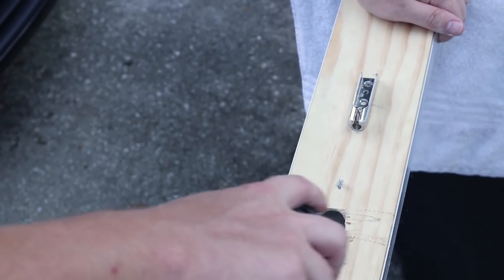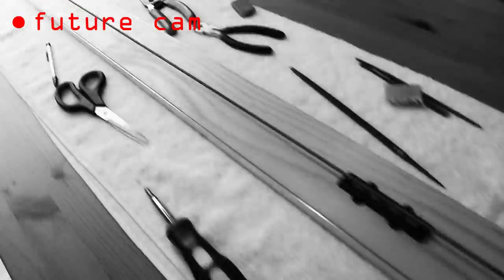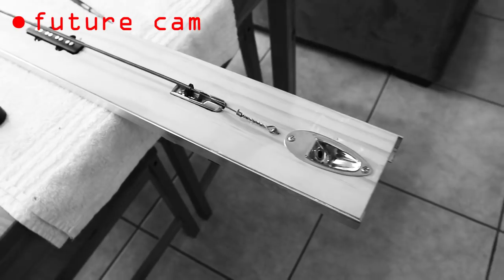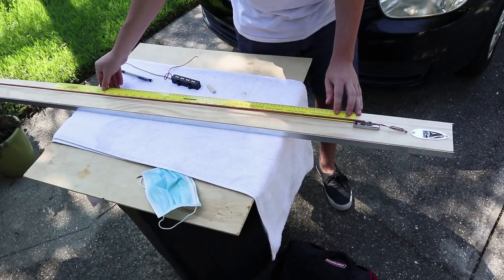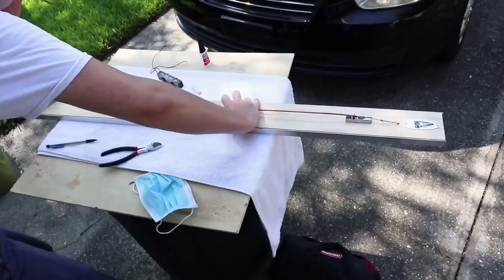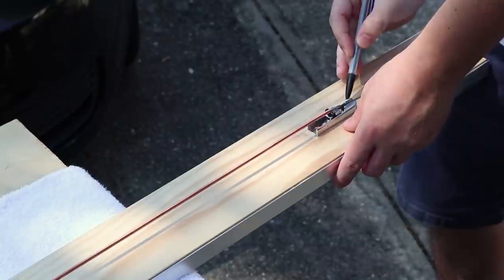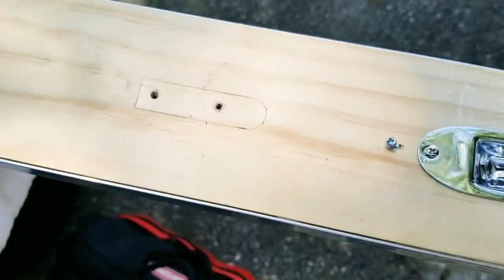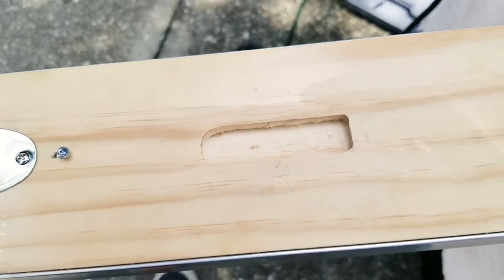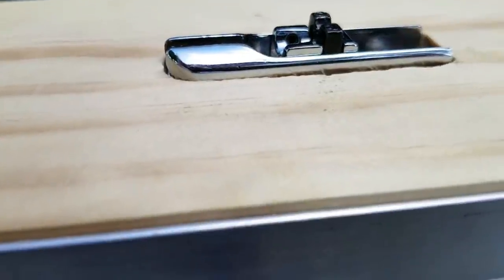Even sanding the area when all was said and done, it's still unsightly to me. But with so much more wood real estate, it's not hard to overlook that area, and I'm more comfortable with it now. Measuring things out to install a wood nut the next day, I had the thought that maybe I should countersink the saddle. The action just seemed too high at that end, and it wasn't in that sweet spot where I could lower it that much before hitting a wall. I'm happy with my decision, but in hindsight, I may have gone too deep. There's always the option to shim it later if I really wanted to, though.